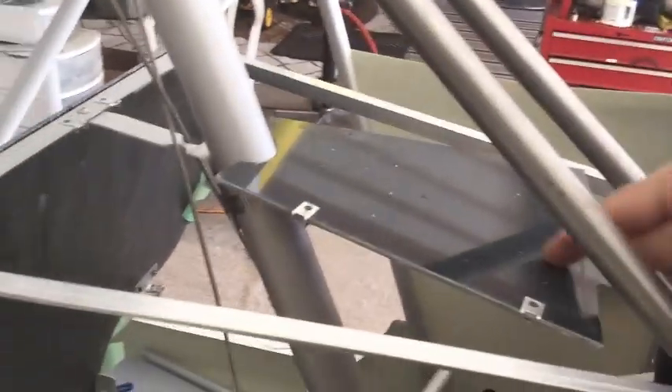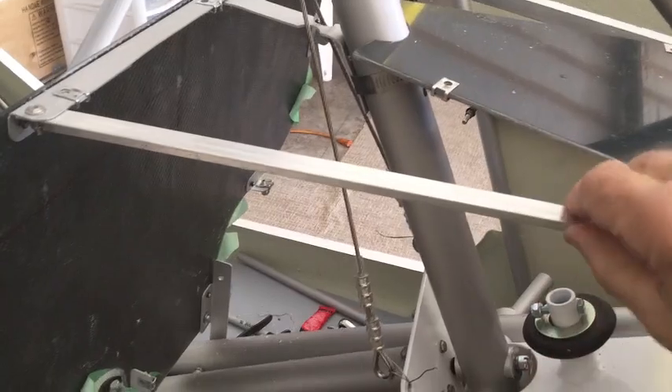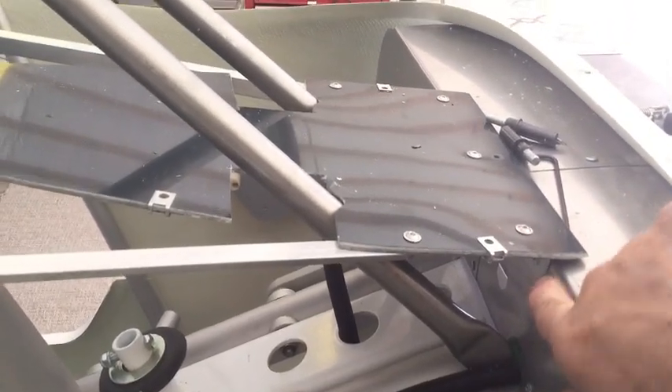The stock instrument panel was just a central aluminum piece with a T-bracket, but it was so flimsy that I went and got some light angle aluminum and bolted it in the front. This is connected to an angle you can see here, and it's hooked onto the firewall, making a much more secure instrument panel. The book doesn't really describe this well. It's not a vertical instrument panel — it actually has quite a bit of forward lean, but it's just the right amount so there's minimal interference from the brake in the full forward position.